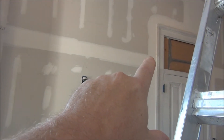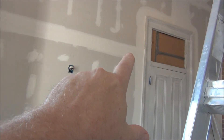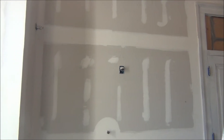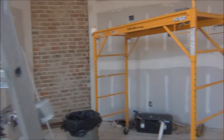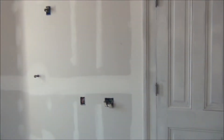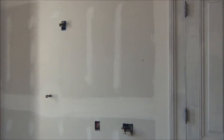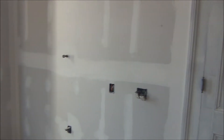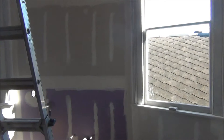That's going to take up pretty much all the way up to the middle of the transom, and you'll have crown to go, so you don't have that much exposed wall above it. I don't think it's really going to show - it's going to be more of an optical illusion. I know it's there, but you're definitely going to have to put filler and fur out the cabinets a little bit. It's not perfectly straight, but the adjacent wall is completely straight so that'll work.